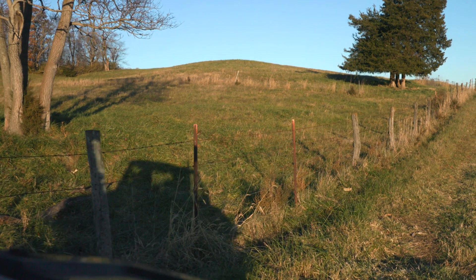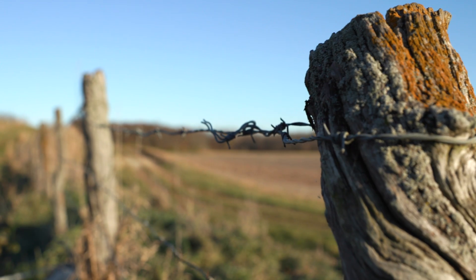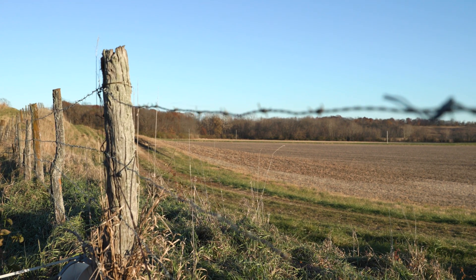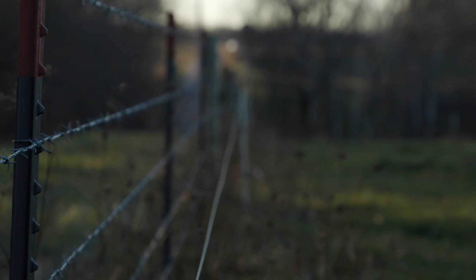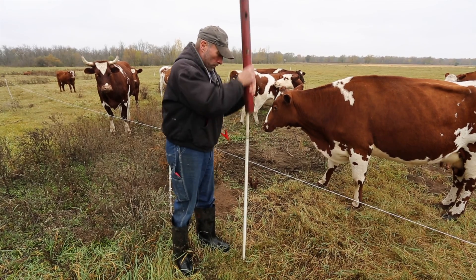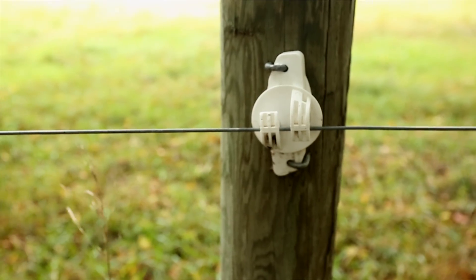There are a number of different products fence can be built with, from wood and treated wood to natural grown wood such as Osage orange, hedge, or cedar, as well as treated posts which must use a specific treatment as specified in NRCS conservation practice standards. You can also use steel T-posts, a composite fiberglass and wood post, or a straight fiberglass T-post. All of these must meet certain specifications set by NRCS.